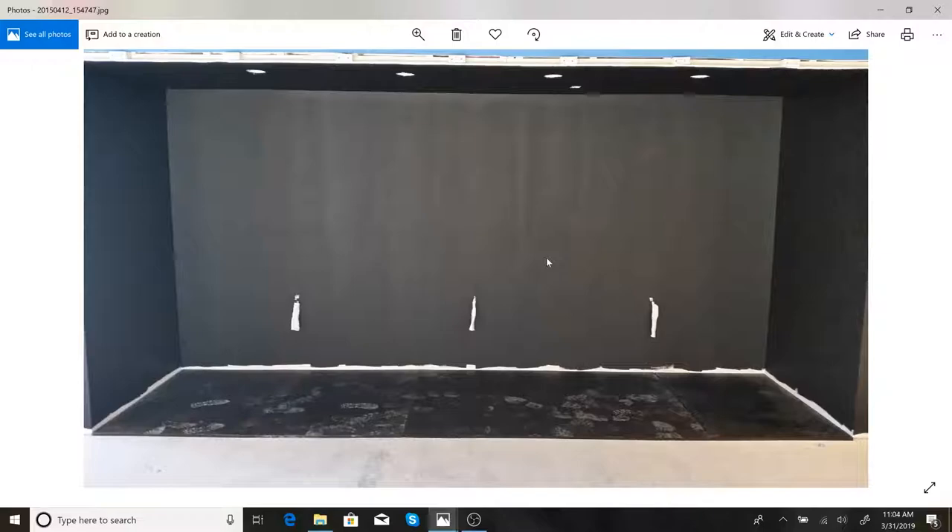One of the complexities of building a home theater on a second floor is the sound isolation. In most home theaters built in basements, the theater stage gets filled with sand — the mass of all that sand helps isolate the sound waves from being transmitted into the structure of the house. When you're on a second floor, you don't have good options for adding literally tons of sand into your stage.